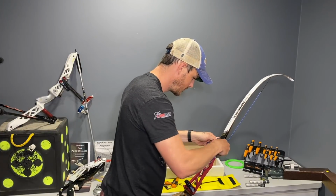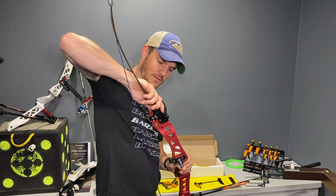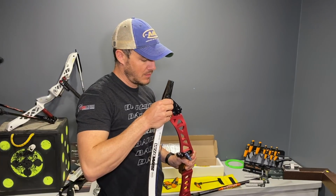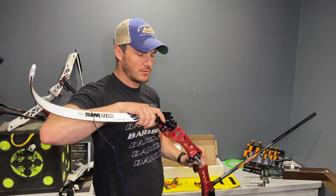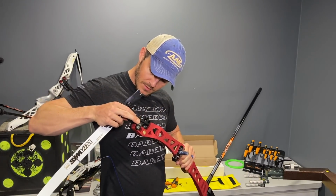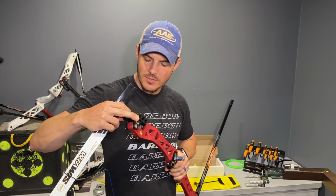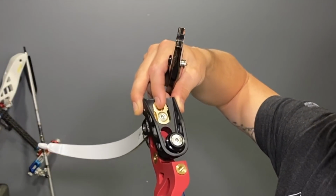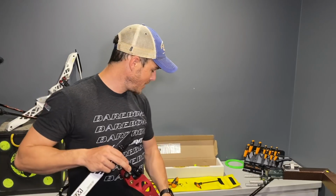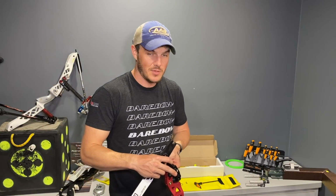Yeah, it's not something I've experienced before. That's weird. So all I had to do was loosen the lock grub screws. Nope. It looks like it loosened the lock grub screws and the adjustment grub screws as well, because now, as I do this, it's got some play to it. I've not seen this before, and I'm going to have to keep playing with this. So with the locks snug again, now it won't move, but I don't understand, personally.